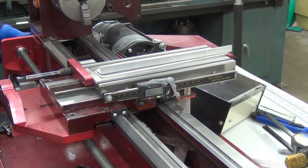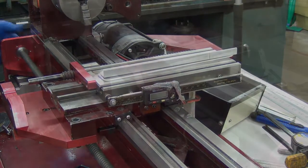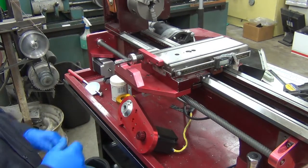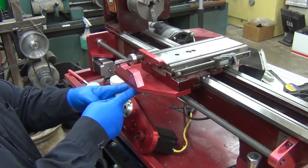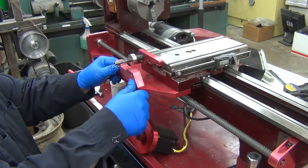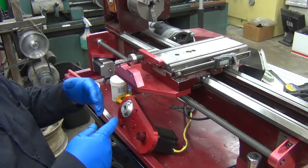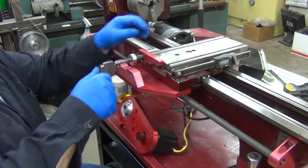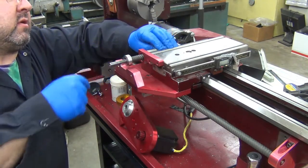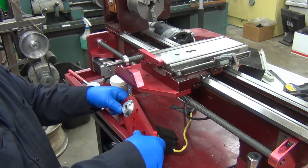So much nicer, and I haven't even put any oil or anything like that in the ball screws yet. I'm at the point where I'm ready to put this plate back on — got this tightened up, and it's slightly recessed behind this. These top two are perfect, so it's not pushing it out. I'm not going to worry about it too much. Since the back of that plate is going to go up against that thrust bearing, I'm going to move that forward just a little bit. I did clean and put some grease in there.